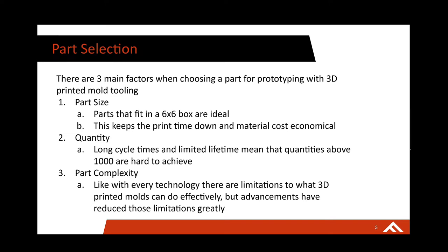Part complexity is also a key factor. While part complexity becomes free with 3D printed tooling, there are some limitations as far as feature size goes. But complexity can also be a key driver into when to adopt 3D printed mold tooling, because it's free. If you have to add in slides, or special ejection like a stripper plate, all those things are free — they're just taken up on the print bed. So you're not adding extra machining time or any extra finishing work.